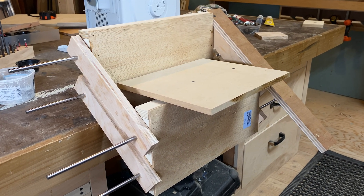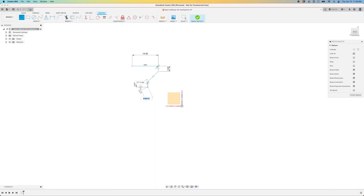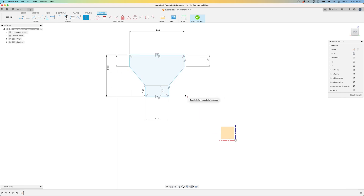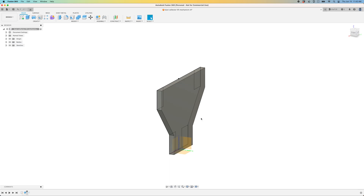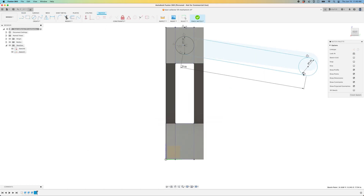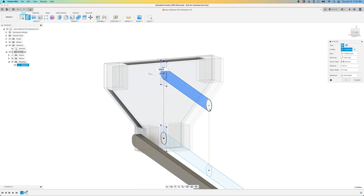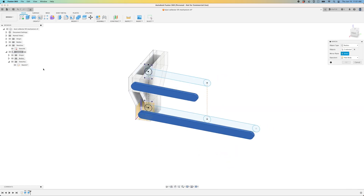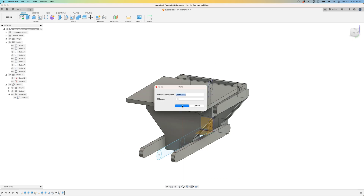This parallelogram mechanism is really the best thing that came to my mind for how to solve this problem. To get the arms and the force under the can, I'm going with a shape that's narrower at the bottom than it is at the top. The two lower arms can push up on the can when lifted from the front. I'm calling it an octagon — the octagon box mounts to the wall with four blocks that let the pivot rods pass through, sandwiched together with a second octagon of plywood. The arms attach to the flat sides; top arms support the can, bottom arms are longer for a handle. A second octagon box swings with the arms, and on top of that a platform for the can.